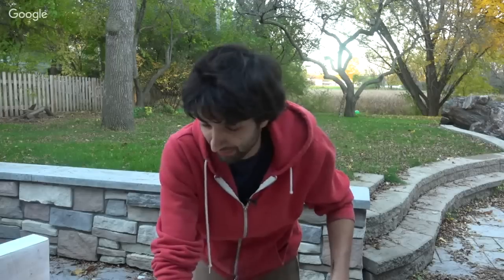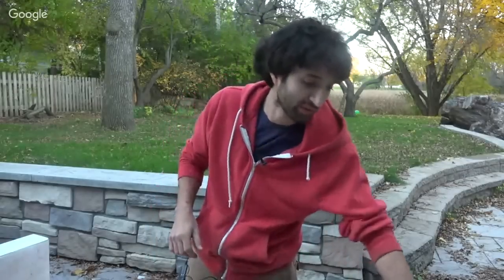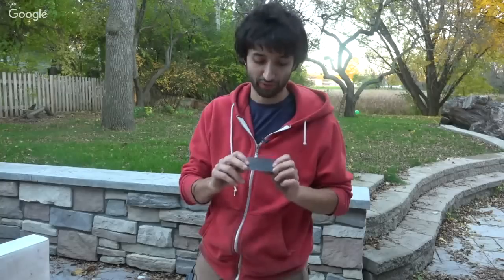From Robin: I used your video on scrapers but it kills my thumbs — any tips? If you can put less of a bend in the scraper as you're using it, that can definitely help. Card scraping is a really demanding task on your gripping muscles and fingers. You can try putting less flex in the scraper itself, or you could try a scraper holder. I haven't tried holders myself because I really like being able to vary the flex as I work, but you could just be pushing too hard.